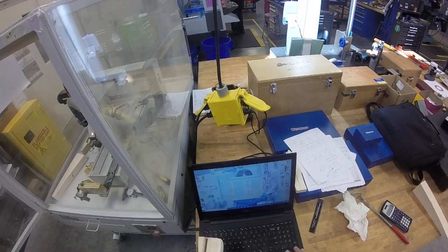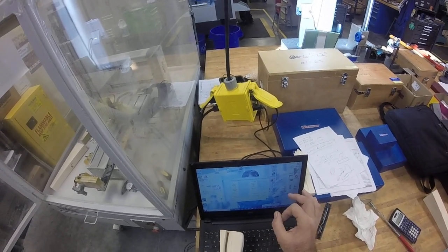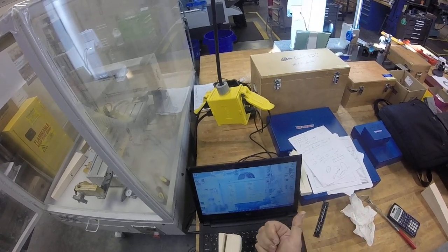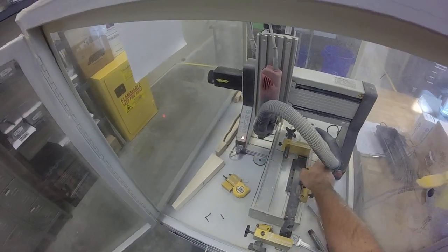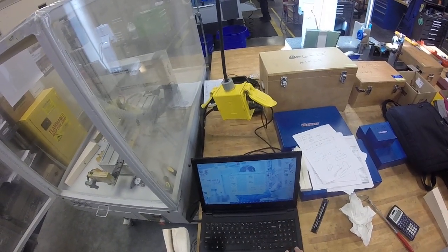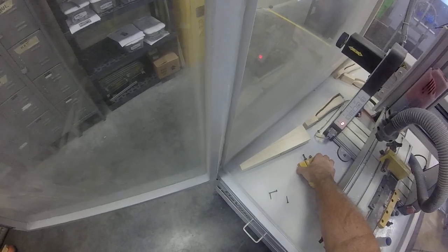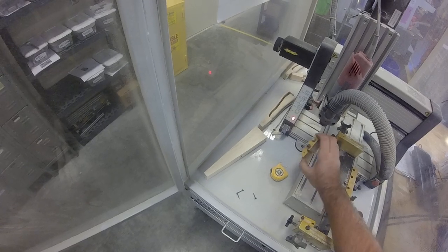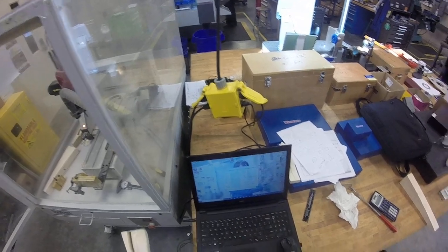Alright, so we readjusted the offset, which was in setup. We wrote down our original numbers. We were at 103.0, so we moved it in the positive direction, so 103.5 millimeters. You know, Y0 being this position, and these are all positive numbers in that direction. So we're shifting it by that. We're keeping the 5.19. This is our new setup. When we use this tool and extended it to the correct length, we're using this for our overall height of the tool, and that would be the 5.19.